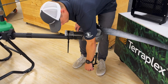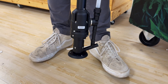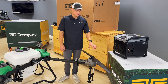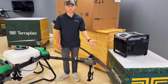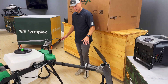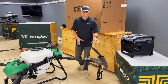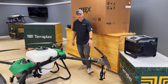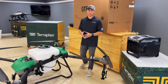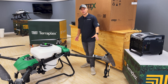One thing to note about the nozzles: there are just three screws on the bottom of your atomized spin disc. Similar to a T-Jet nozzle, it's going to wear out eventually, so we will have a maintenance schedule with recommendations for when you need to replace those nozzle tips. With three screws it's pretty simple to take apart and put back together yourself. The swath design — the way it sprays — is a little different because of the engineering between the motor, the props, and the discs and how they're all positioned. You get a wider swath and it works outside-in, whereas all other drones on the market work inside-out. Because of the way it's designed, it can put out a 45-foot swath.